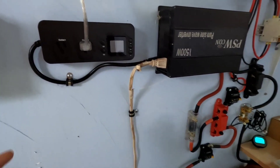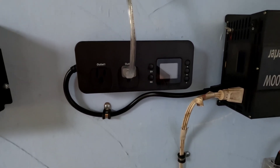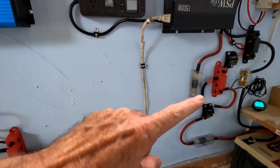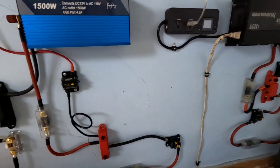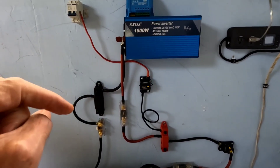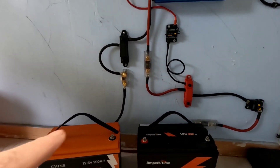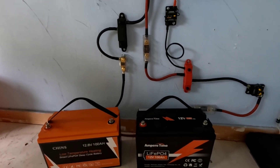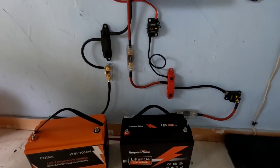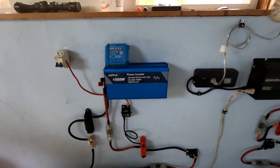I like to have this little watt meter on here so I can see what appliances are pulling what, and also for demonstrations so I can show you guys. This is just a great little system and I just copied it on a slightly smaller scale. I'll have 1500 watts — I'm just going to tie in two 100-watt panels to this — and that'll charge these 100 amp hour lithium batteries plenty fast enough for my usages. I just want to always be charging some batteries and be able to move them around so the power wall continues to grow.